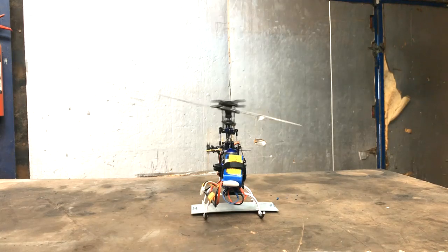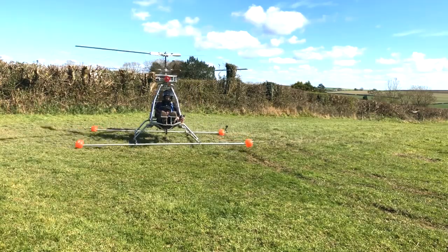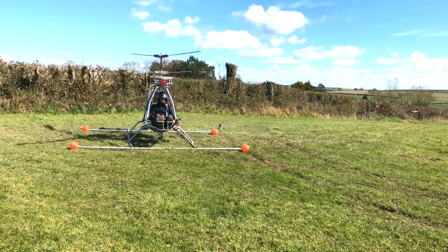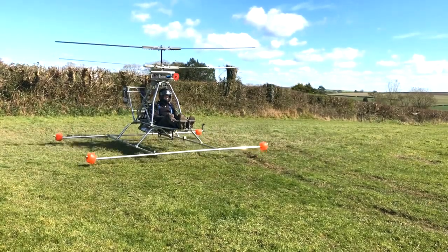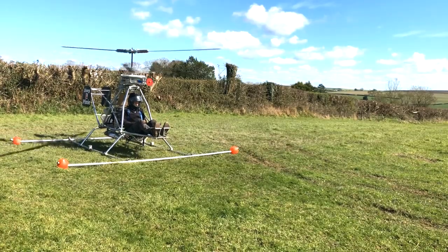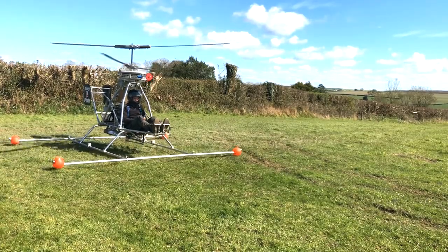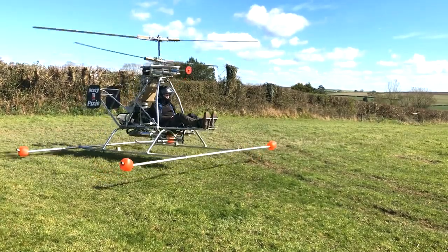The docile control of this system is useful for flying in gusty conditions, as any upset from the aerodynamics is played out over a longer time period, and the magnitude of the upset is reduced. My helicopter didn't have any stability enhancing features, and when the wind turned gusty, it goes from very stable to very unstable. You can see what trouble I'm having in this final video before the drive shaft broke. Earlier on, with the wind calm, there was no problem with stability, but later the wind changed direction and became gusty. I was having a real hard time keeping it under control — a huge difference.